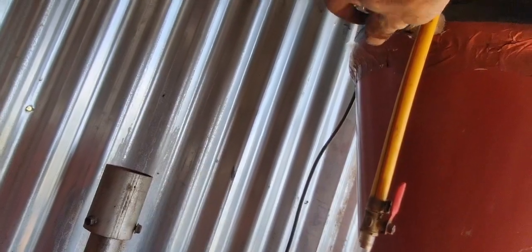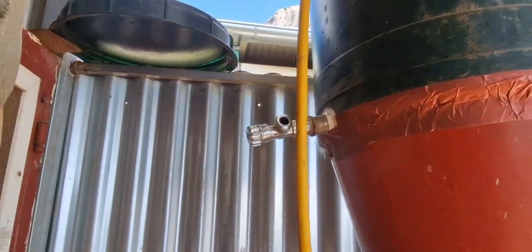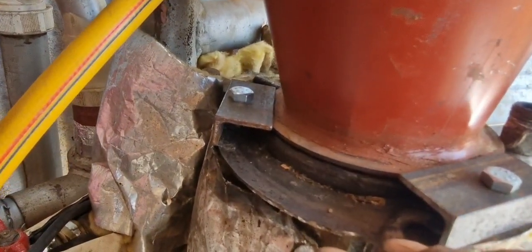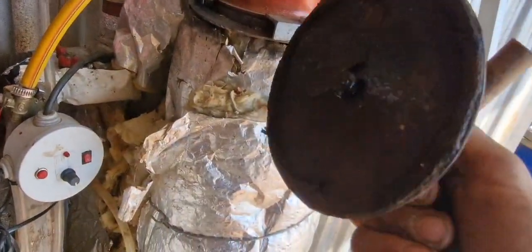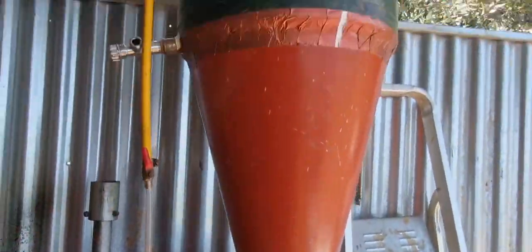On the bottom of the moderator there's a half-inch coupling here — I was just cleaning the valve out; it was a little dirty inside from sawdust. It captures some of the moisture, which is great. This cone is bolted on with these bracket plates — literally translated from Dutch — pushed in here with fire rope seal and fire silicone.